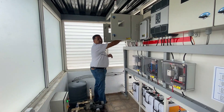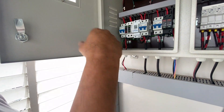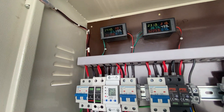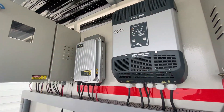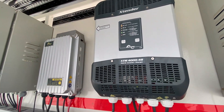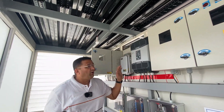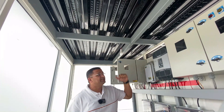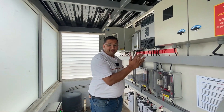In an emergency, if required, we can always switch the grid on. Once we switch on, the grid comes and starts powering — the inverter can receive grid input as well. The grid can also charge the battery; that is the whole idea of connecting the grid. If required, this can also export power back into the grid, however for this particular site that feature is not enabled. In about 30–40 seconds, the AC power will start reflecting on the inverter. Once we finish the video, we are going to switch off the grid again.